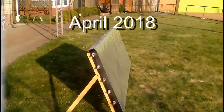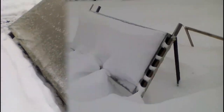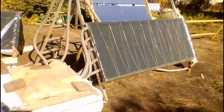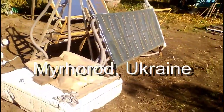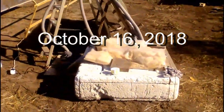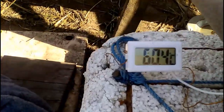I made this solar collector almost a year ago, and then I performed some technical testing of the collector in different weather conditions. In addition, I measured the energy capabilities of this solar collector, and now I am showing one of my experiments when the collector has heated 36 liters of water in this tank from a temperature of 14 degrees Celsius to 68 degrees Celsius over 3 hours.